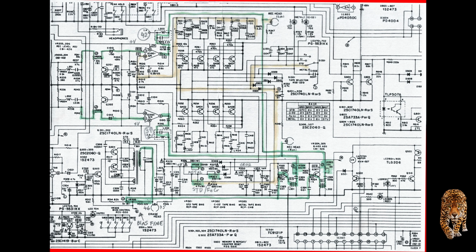Now, audio meters, I do have 1 or 2 digital meters that will measure audio, but I actually acquired a number of analog meters. I found them much more easy to use when adjusting for maximums, etc., or for aligning two signals to be the same. While the ones I got are fairly cheap and they're not totally accurate, on the 1 volt range they are all identical, so that's good, and they're not far out, close enough for what we're doing here, and one day I will calibrate them for each and every range. But analog meters, they're brilliant. It makes life so much better.